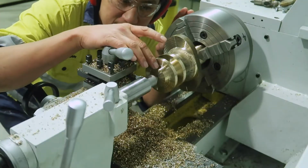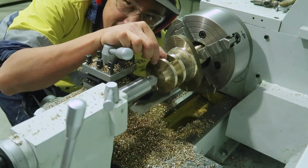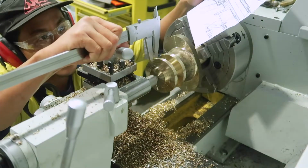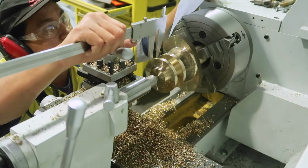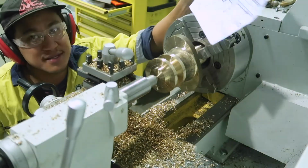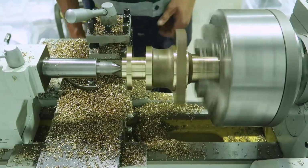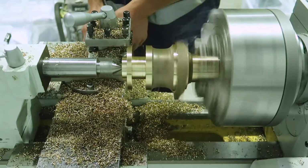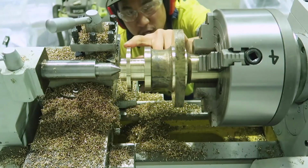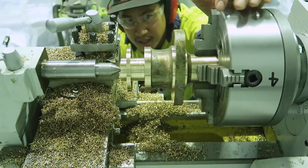Alright, now that that's been machined down to accept that thrust bearing, all I need to do now is machine this flange, this little flange here, down to 6 millimeters. Just let me go and measure this. Ooh. So that's currently 8 millimeters. Sorry, I need to take 1.5 millimeters off to get it to 6.5, and that's the final thickness the drawing says. Alright, that's 6.3 mil. It needs to be 6.5, which is good. So it's got 0.2 clearance.